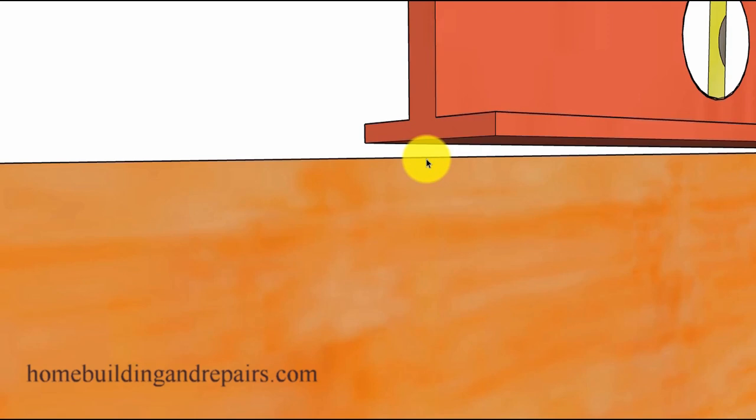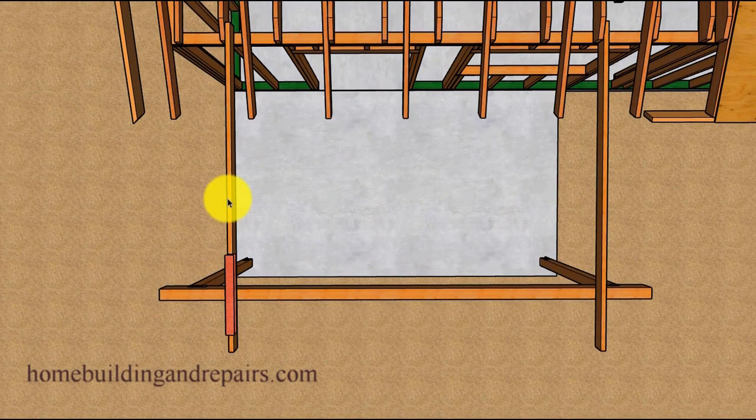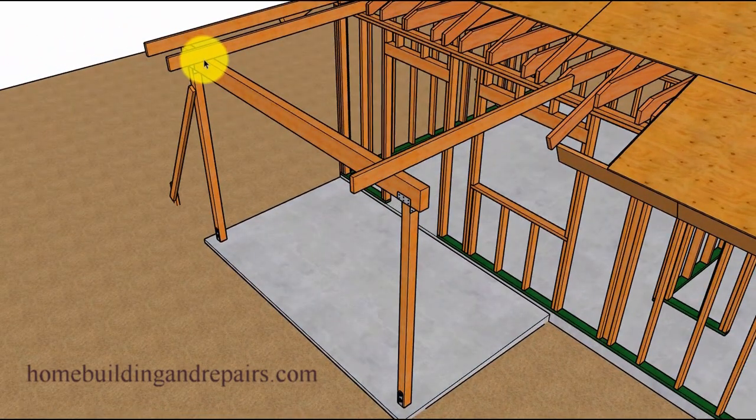For example, if we had a 1-foot long level the distance should be a quarter inch; if we had a 4-foot long level it should be 1 inch. Another thing I do when building patios to speed up the process is nail one of the roof rafters into place at each end and then vertically plumb up the posts so they are straight. You might be better off just bracing all the posts and plumbing them in both directions using some type of bracing, then setting your straight edge or roof rafters on top to check if you've got the right slope.